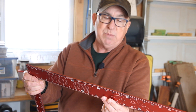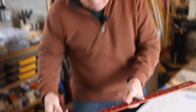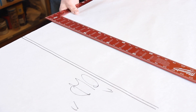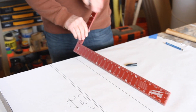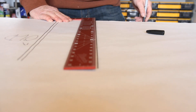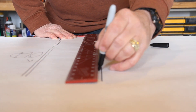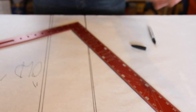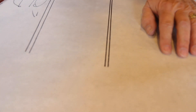I've just recently bought this brand new Milwaukee square. Love this square — it's beautiful, the color is nice, it's easy to spot in the shop, and everything's laser etched on here. But let's test it and see if it came right out of the factory perfectly square. We'll pop it onto the edge of the table, push against it firmly, and draw a line just like we did with the other unit. Now we roll the tongue over — and look at that, we have some divergence. This is pinched in slightly. You're seeing the doubling error: the lines start together and by the time we get out 24 inches, we've got well over an eighth, maybe three-sixteenths of divergence.